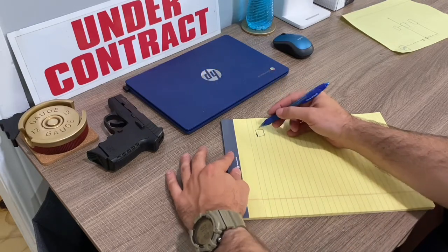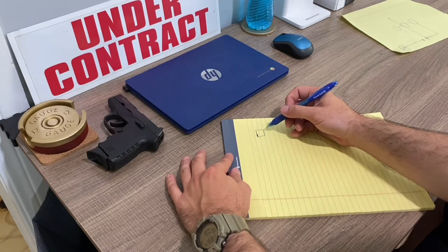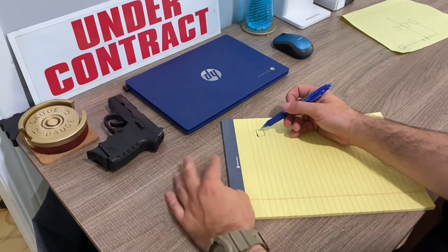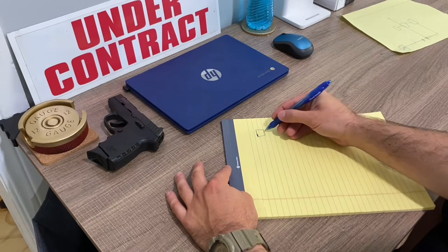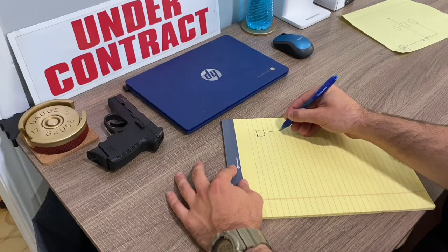Here's a panel box. The panel box has hot wires coming out of it — they're always hot unless the breaker switches off or the main panel breaker switches off. So always when messing with electricity, turn off the electricity first. Shut off the main panel breaker if you're confused or don't know which breaker it is. If you know which one it is, go ahead and shut that switch off.